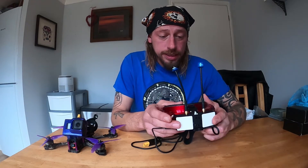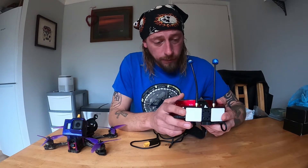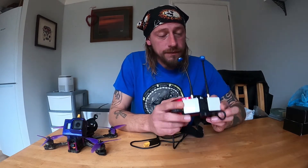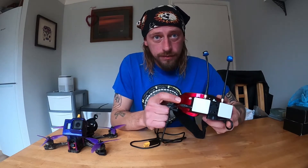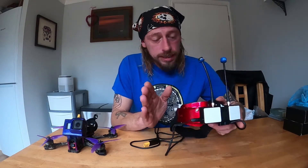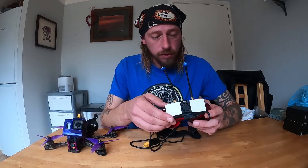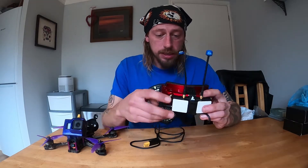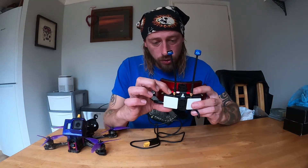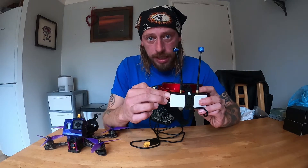Now, this is an easy thing to fix, but when this happened to me, the first thing I did was go and update the firmware on the goggles to the latest version. I'm not sure if that is the best idea, because when I actually tried the fix for it, I couldn't get it to work. The fix for the colours is to press the jog wheel and hold it to the left — that brings up the VRX display menu.